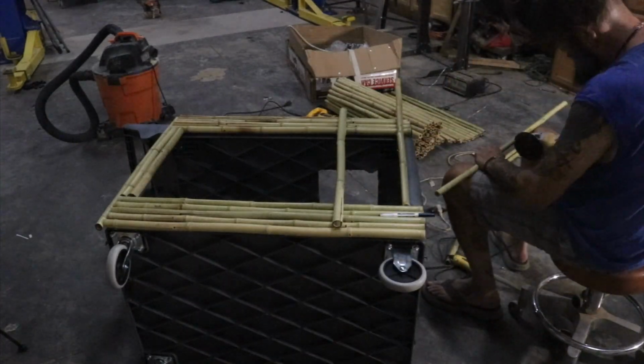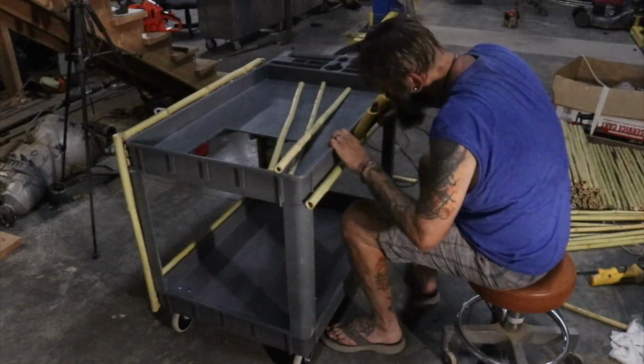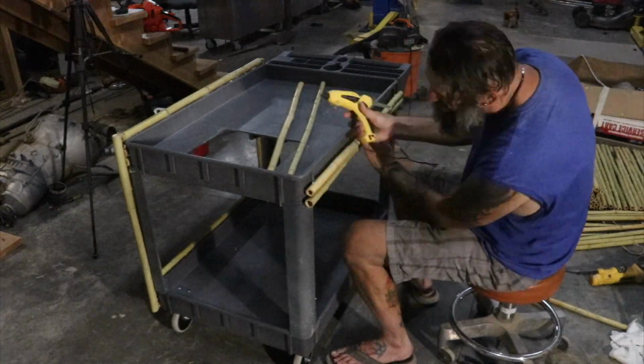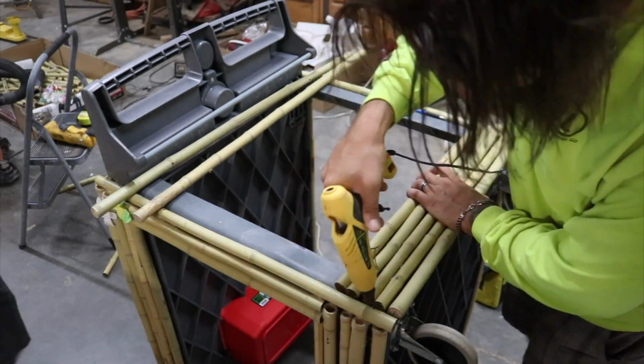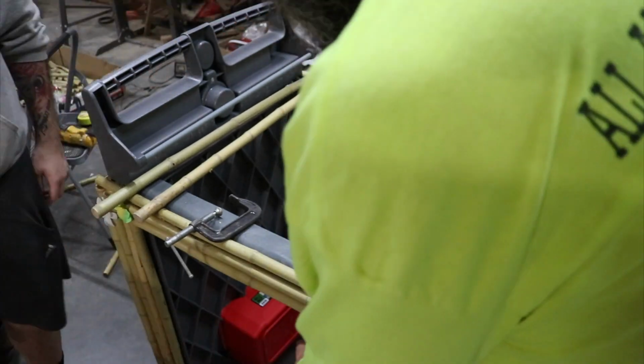And what we did was we just bent the nails back when they came out through on the other side. That way they wouldn't slip out in the future. We cut some of them because of the location, and we bent others, but that's something that worked out. I would highly recommend using the brad nailer where you can, and then using glue in the spots where you can't use the brad nailer.